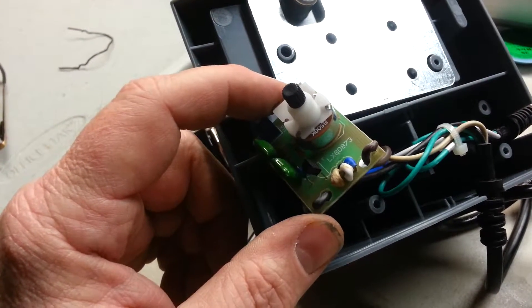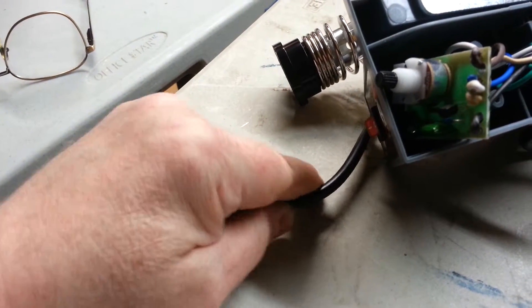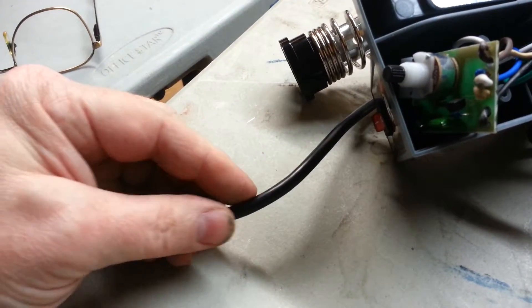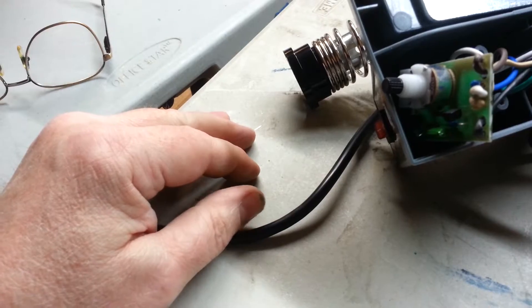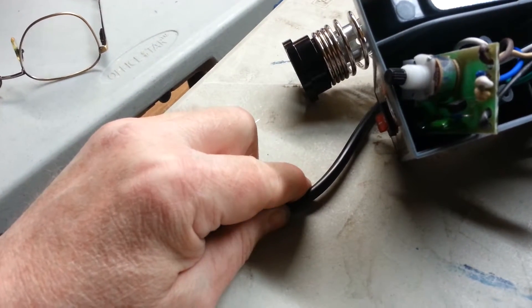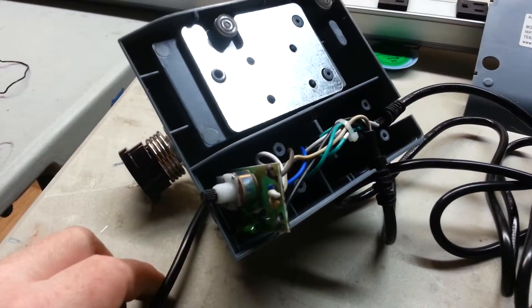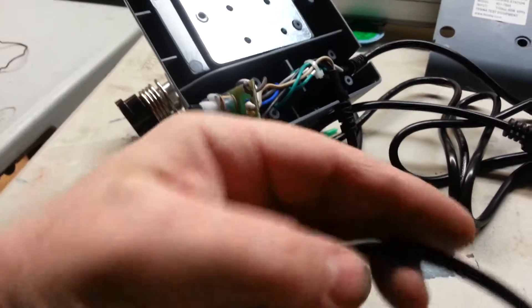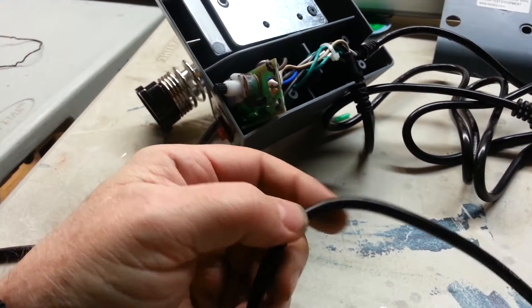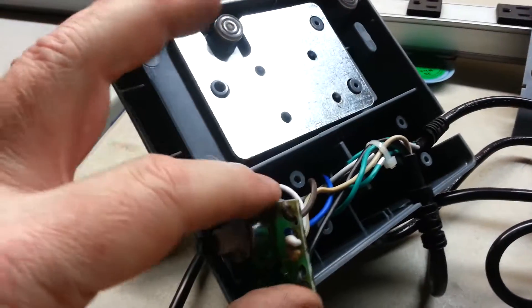For the price, it works just fine. The biggest issue with cheap irons is that they give you these really stiff vinyl PVC insulated cords — about as stiff as a regular computer power cord. If you let it relax in a warm room it's not too bad, but if you wrap the cord up to take it anywhere, it tends to get a set to it and makes it very difficult to unwrap, and it keeps trying to jump around depending on where you move the iron.